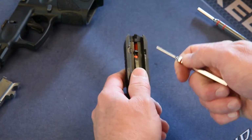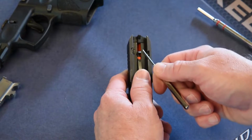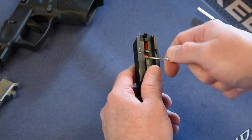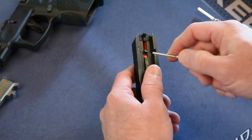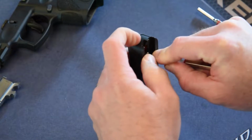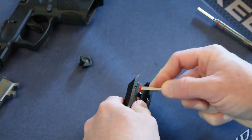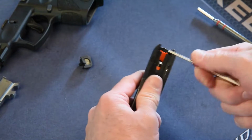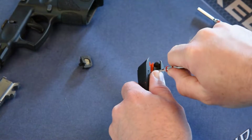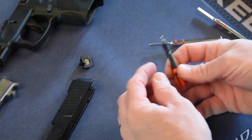The G2 firing pin assembly, the sleeve more specifically, is pushing up against the slide cover plate under spring tension. So in order to remove this, you're going to have to take a punch, something smooth, push down on the sleeve slot right there, while simultaneously working your fingernail in behind the plate and removing it. Now at this point, simply take your tool, put it in this slot, and slowly work it out of the channel, and that'll remove everything.